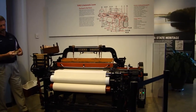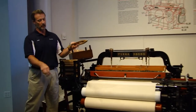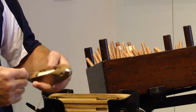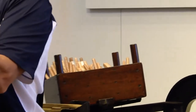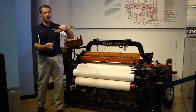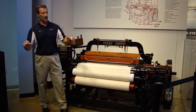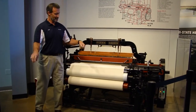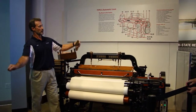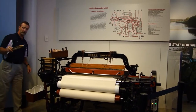The shuttle itself is very innovative in the way that it's loaded. Mr. Toyota figured out a means of improving the shuttle loading. Originally, the operator would hold the shuttle in one hand and the yarn in the other, and the object is to get the yarn out of this hole. Standard practice in the 1920s was to hold a fork in your teeth and pull the yarn out, or many operators chose to simply place their mouth on the shuttle and draw the yarn out — fine for first shift, not so good for second shift. So Sakichi figured out that by using a groove system in the opposing hole at the right angle and using recoil, he could snap the yarn and make it appear on the other side. It saved health issues and was much faster than the old method.